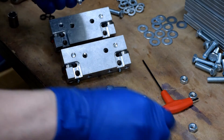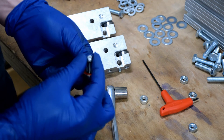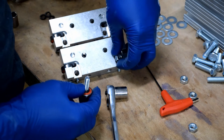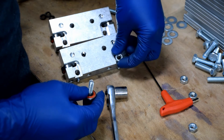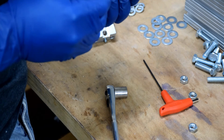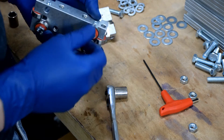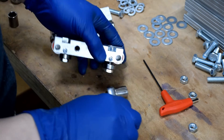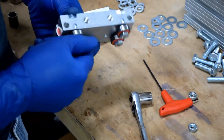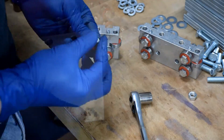The bolt, the bearing, and the lock washer go together the same way. But instead of a threaded hole, there is a nut retaining the bolt on the back end. Thread the two together, but leave things loose so the bolt can slide around. Repeat this step with the remaining bolts and bearings, remembering to leave things loose.